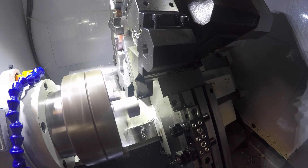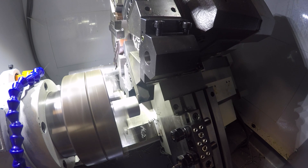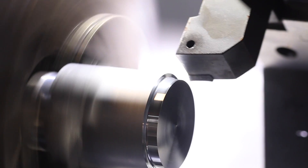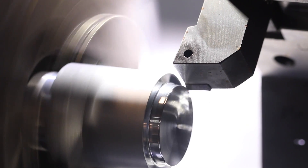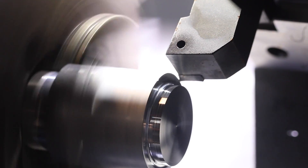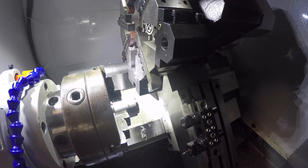No coolant because it's much better for the video — that's actually one reason I keep using the Trico on the mill. This three-jaw does have some runout — Adam Booth would not approve — but we'll see if it causes any problems. The finish pass is going to clean up the shoulder, then a tool change to the groove tool.